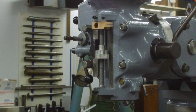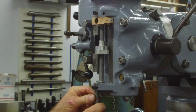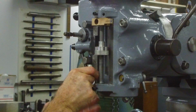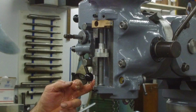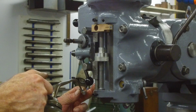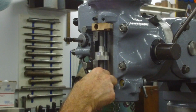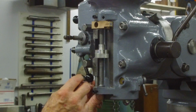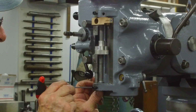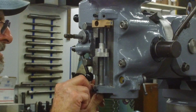Alright, so we're going to oil this up, and we're going to slide that right into place there. Alright, and we can feel that motion there. This finger has got to hold that up. We're going to squirt some oil on here. Plenty of oil is going to get squirted all over this thing after we're done. And it also has to line this up here. Now this pin has got to go in there, and it's got to hold that, but I know from experience that it makes a big difference if you semi-align that hole first, just like that.